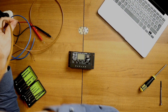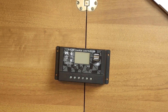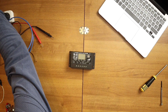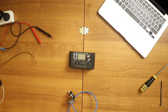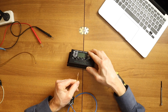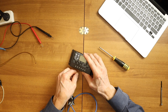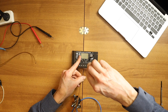Now connect the charge controller to all the peripherals. They want you to connect first a battery. We take now the two poles of the battery — here they are, plus and minus — and they go to the central connections. We take this screwdriver, put it here inside, and first make it completely open. You can do this with a hand screwdriver because then you regulate the force better.